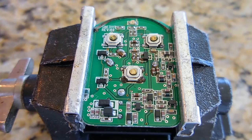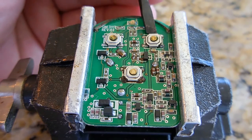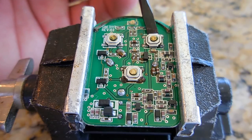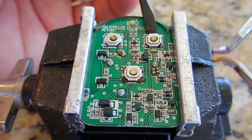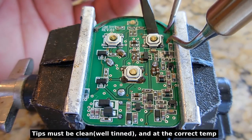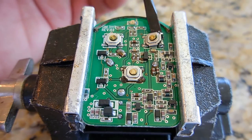Okay, let me position this under the switch on one side. The blade, very carefully. I'm going to reach in at another angle. Hopefully I don't block the camera. The tweezer tips are set at that spacing. When you squeeze it, it goes together. And you see how nicely that side lifted up.